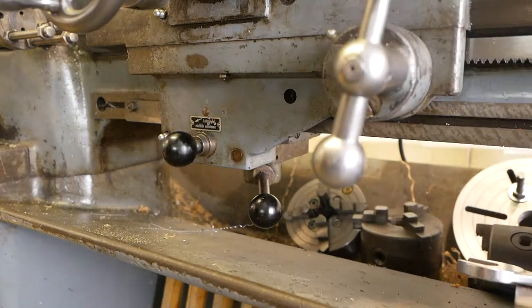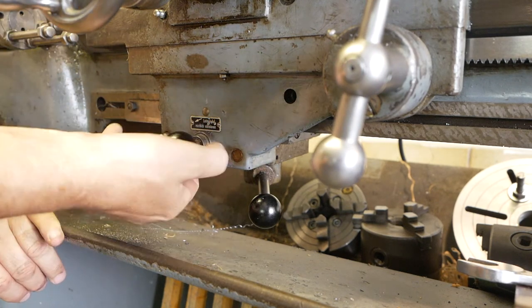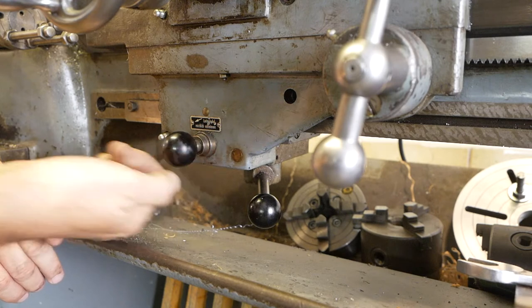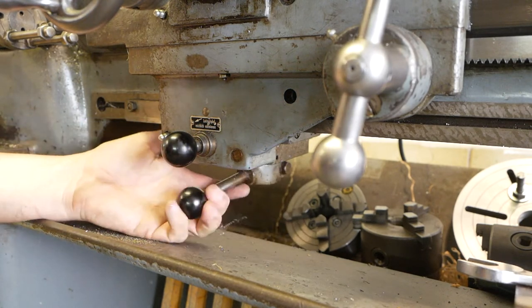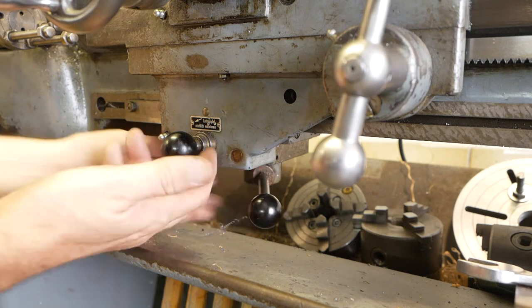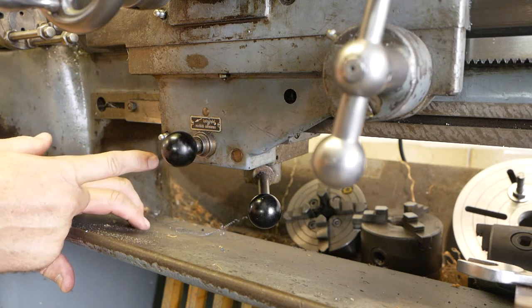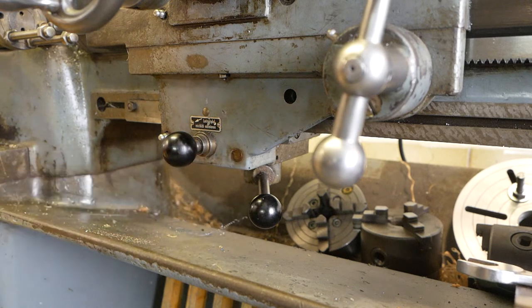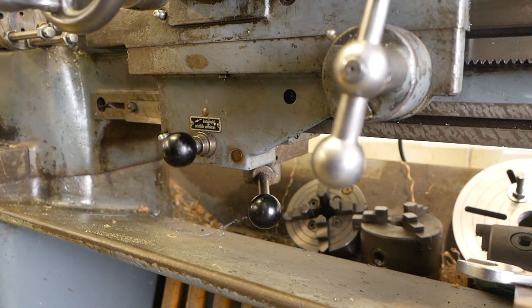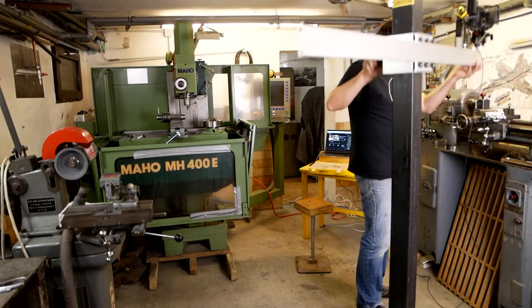Two and one. What I'll do is, as it reaches the end of the cut, I'll not only pull the release switch, but I'll also be pushing back on this as well. I have had that in the past as well. If it doesn't release, once it starts crashing and the pressure comes on, then it can't release. So it's not an ideal piece of design, or it's probably just worn out, it's old. So setting that back up again.